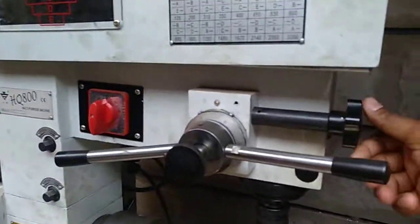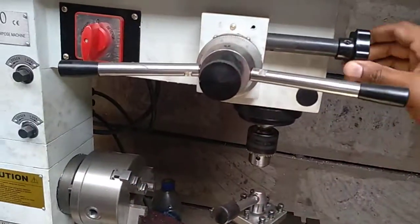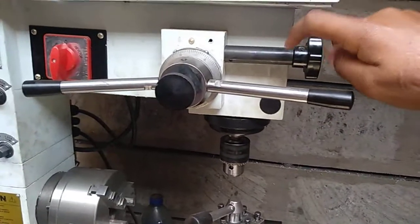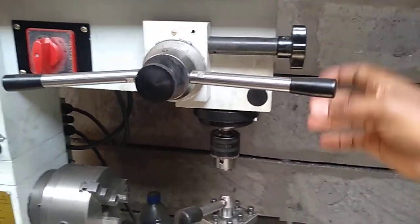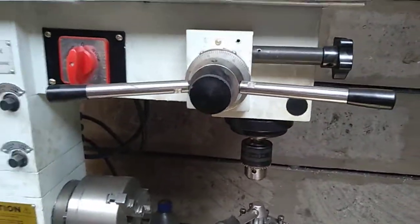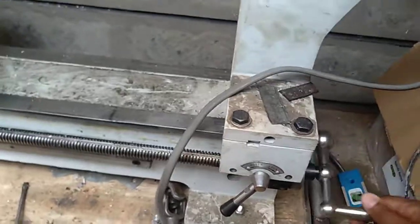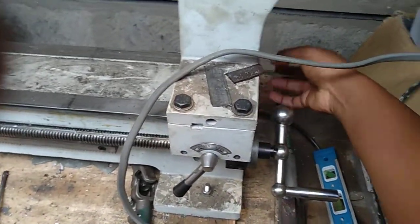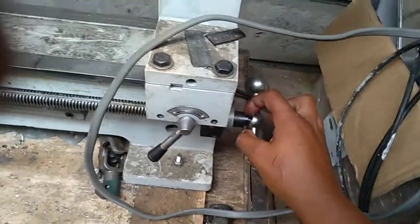So basically, this one is micro-feeding - you feed up and down. When you engage, you micro-feed. So I'll connect the NEMA 34 for the Z axis here for micro-feeding. Then for this axis, I'll connect it here - I'll remove this one and connect the motor here, driven by the belt to this one.